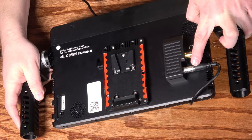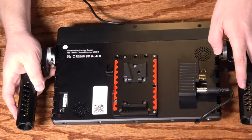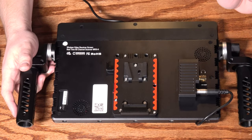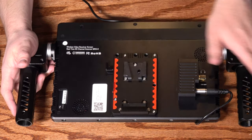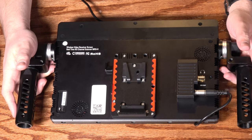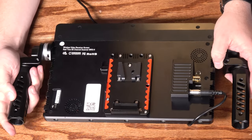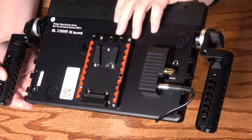Normally this unit does not include a power cable — I just happen to have one that worked. In addition to AC power, it also has a V-lock battery mount, which is the primary way I've used it. It runs for quite a while on a V-lock battery; on my last shoot we had the monitor on for several hours without replacing the battery. There's also a USB connection on the back, presumably for firmware updates, though there's no mention of that in the manual and no firmware updates on their website currently.